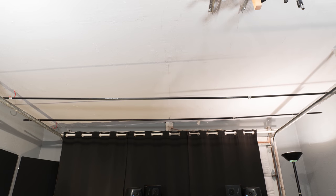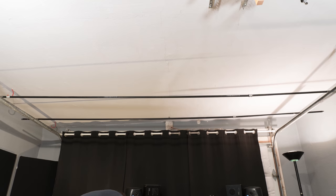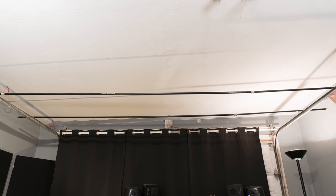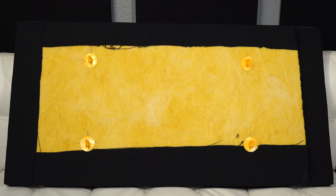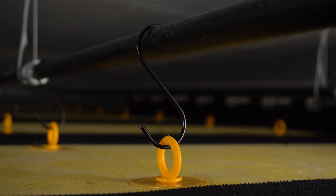For the ceiling mounting, I decided to use the garage door tracks to hang a span of one inch steel pipe across for an extremely easy suspension device. Place the cloud anchors 12 inches in from the length and 6 inches in from the width, and hang them with the S-hooks. And that's it for mounting the panels in our Recordio Studio.